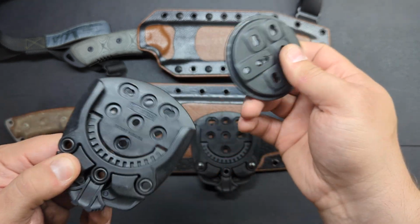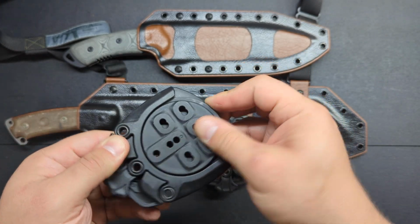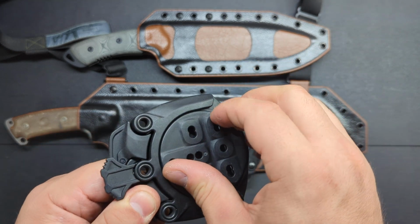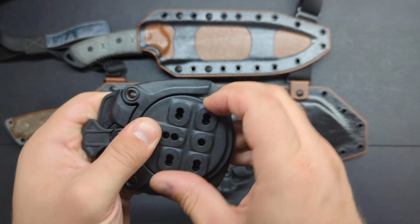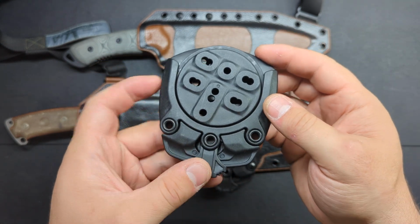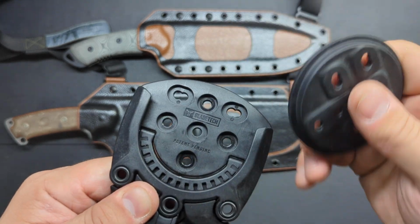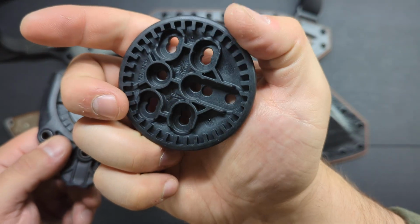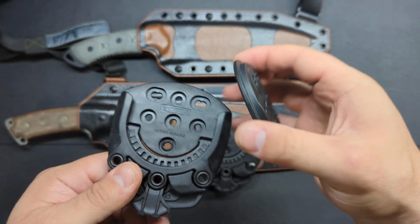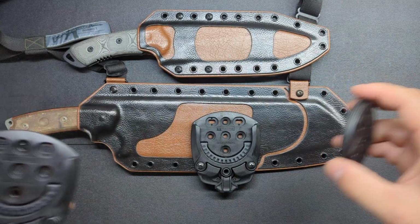But basically, it is a disc or male part and a receiver or female part, and they simply fit together like so. And then you can depress this lever here. It's a little spring-loaded lever, and it allows you to rotate the male. It's actually really hard to do without something to grip onto. It lets you rotate it 10 degrees before its next click, and you can continue to do that 360 degrees. The reason it can't pull out is because when those teeth are gripping into the teeth on the plug, you can see that there are angles that won't allow for upward movement. But when you depress this, it allows the disc to spin freely. So it becomes a really, really nice way of attaching.